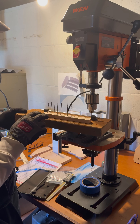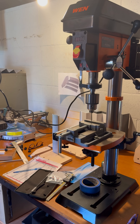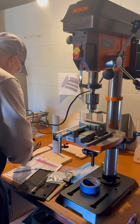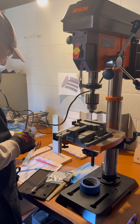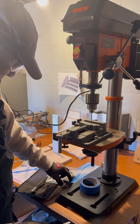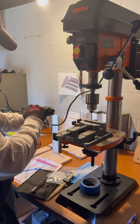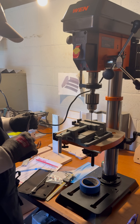Anyway, we're going to go at it and see what we can do. Another interesting tidbit: to center the drill properly, I'm going to use these V-blocks in the vice grip. I also printed out these little 3D caps that sit right on top of the piece — there's a small hole in them that lets me center the drill on the part.